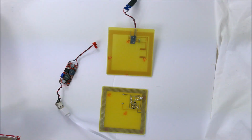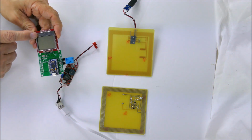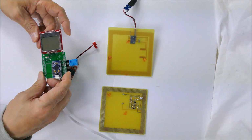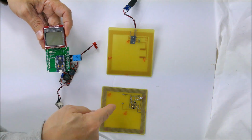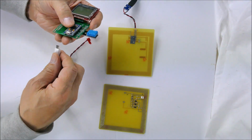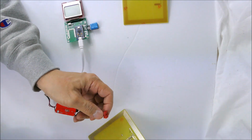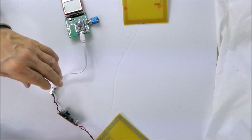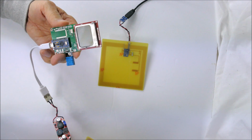And of course we need some instrumentation to run, so here we have a little temperature sensor connected up to an Arduino, which is also running an LCD. And we'll be able to see the display of this LCD through the window. So this thing will be completely outside the window, just measuring the temperature and displaying it on the display, and powered through the window, so no wires going through the window. So let's connect that up. This guy connects in here, and he's powered from this one. I want to keep that separated until we get it all connected. So now we have a power supply and a remote instrument.